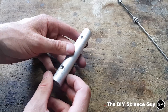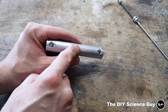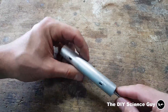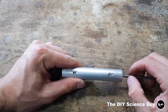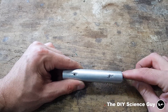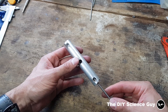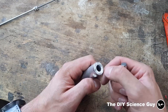All the sharp edges are gone now, so it's quite smooth inside. I've also drilled these 8 millimeter holes — this is the inlet hole and these are the exhaust holes. I also made a new rod so I can put the seals farther apart, and if I put this in here you can see that like this they're both closed off. If it goes to one side, steam can go through this hole and out on that side; if we push the other way, steam will come out here and exhaust steam can go through there.